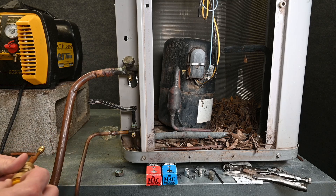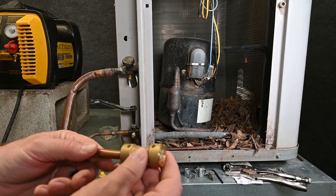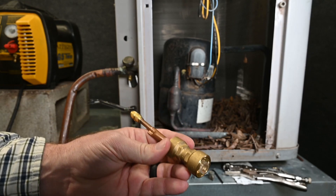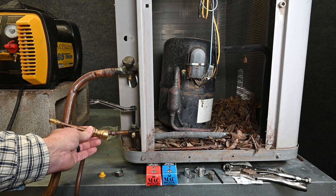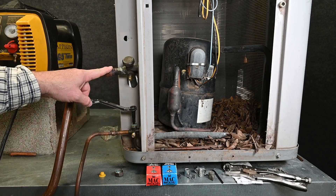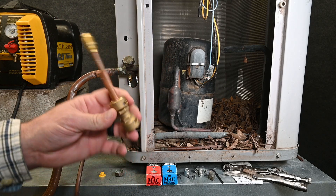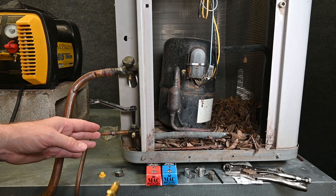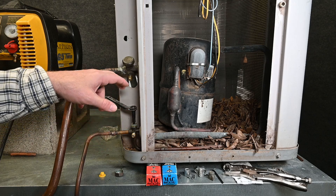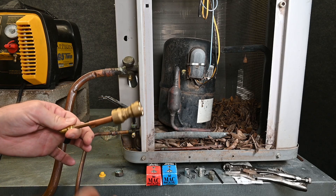The modern and newest method, and the one I'd recommend the most, would be this one here. We talked before about these quick connects, and there's a little tool where you can disconnect and reuse these. What I would do was take a piece of copper on the other side, braze on a little service port where we have our gauges hooked up. This one is for 3/8ths, and I could simply slide it right onto that existing 3/8ths connection, and that would open this valve back up and I could start recovering. You get two more sizes - one for 3/4 inch copper and another for 7/8ths copper - and you could simply slide this connection onto two different sizes and recover from both sides. It's a nice quick way of doing it and fairly inexpensive overall. In the old days, to make that same thing happen, we would have to pinch the line closed with some type of pliers, braze that connection closed, then open the valves and start recovering. So without having to do the torch side of it, this tool makes it a whole lot faster. But these little fittings are fairly new to refrigeration.